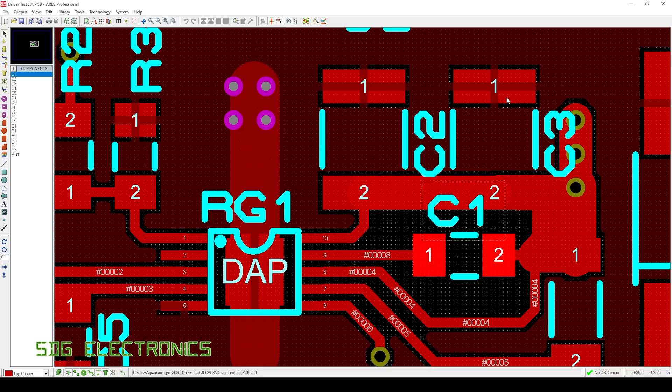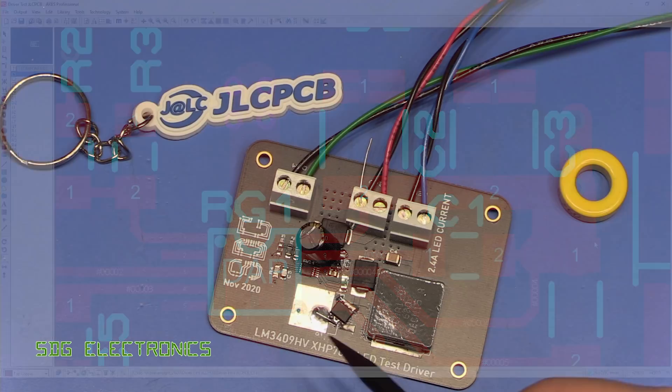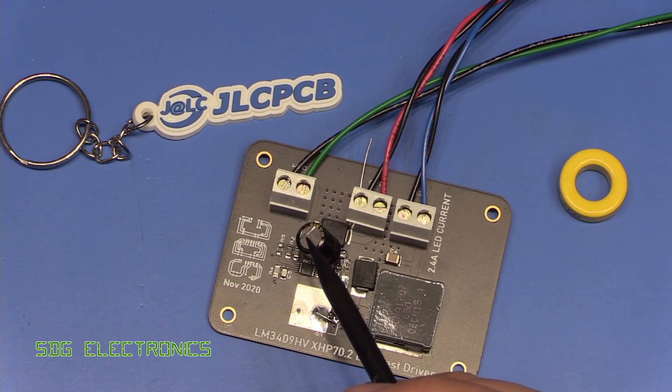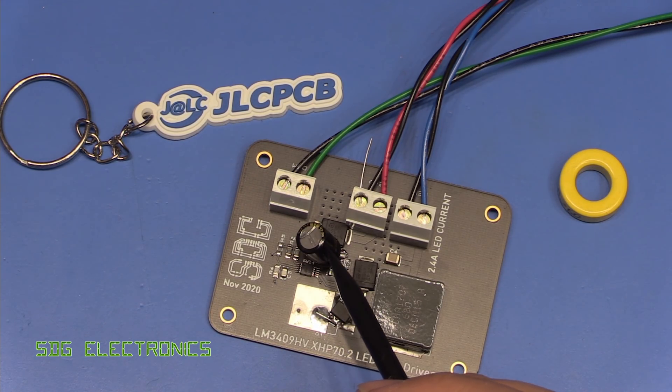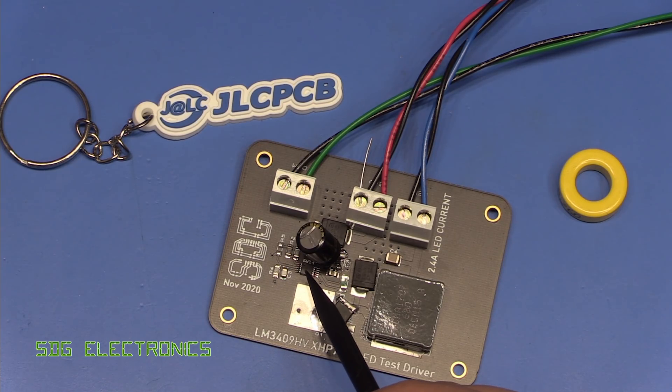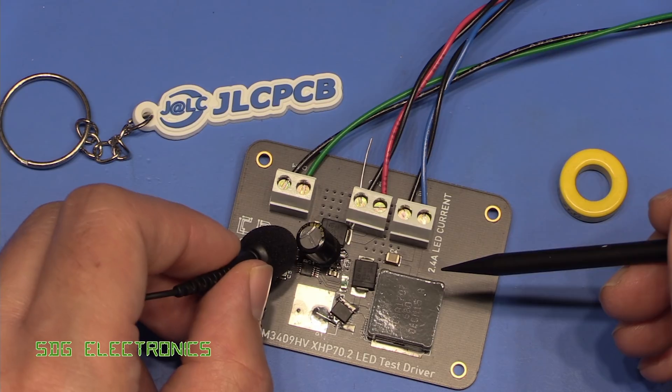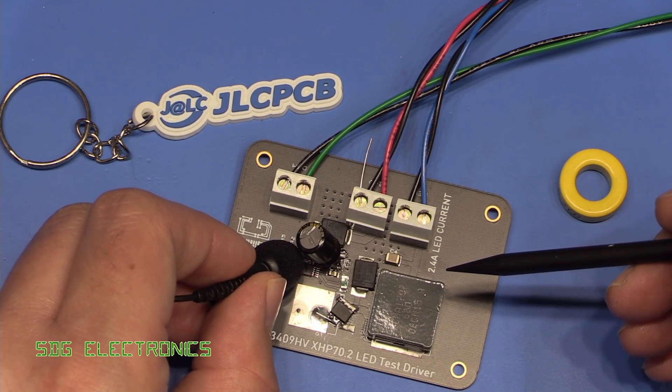What might be interesting now is to desolder those two capacitors temporarily and try replacing them with electrolytic capacitors, which are not microphonic, and see if we still get that same noise. So this poor PCB is getting hacked around quite a lot. We've got a 100 nanofarad capacitor and then a 150 microfarad electrolytic over the top of it — we do need that small capacitor to keep the switcher IC working properly. Let's turn it on and see if we still get the same noise — and to me that sounds pretty much the same.